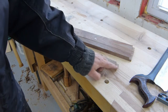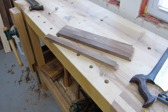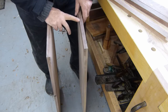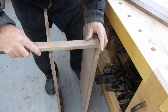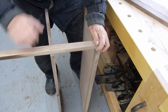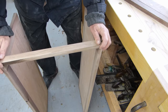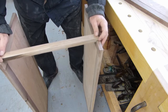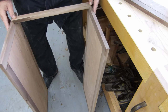So now what we've accomplished is four pieces with a half-lap on them, with the insides of the shoulders each exactly the same distance apart. What I'm going to do is cut a little dovetail on each one of these, and when I get my sides to go together, they will help space them apart at the proper distance — one at the front, one at the back, top and bottom.